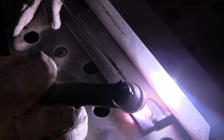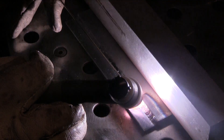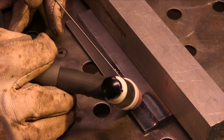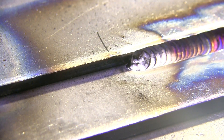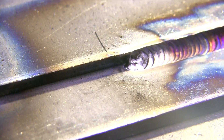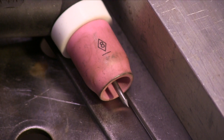I'm trying to pull the top toe of that filler metal all the way up to the corner to make this a full fillet weld, trying not to leave any little chewed-off areas. I'll taper off — it only takes about a second or two to taper off because with mild steel it's just not crack sensitive. You don't have to taper off very slow. Other materials that are crack sensitive, you do have to taper off a lot slower. There's the crater — that's where we're going to restart. I'm going to view that as a target and a bullseye, and I'm going to aim at the center of it with my arc, lighting up on the center with a nice fresh, sharp electrode.